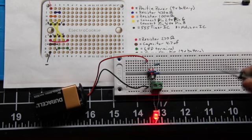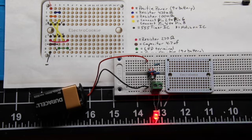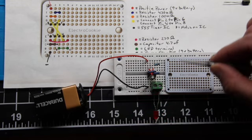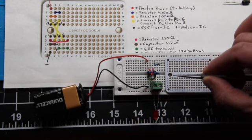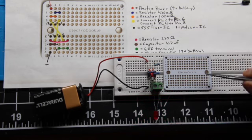So we've mocked this up on the board, and I would tell you I'm very bad at spatial relations. So what I did is I just got a pack off of Amazon of PCB boards that basically mimic the breadboard, so that I can just take what I've done here and knock it right off verbatim, or exactly, onto the actual PCB board. As you can see on the back side of this, actually that's a good view of what the inside of the breadboard looks like. You can see we just got rows of copper, so that anything on that row is connected to something else on that row. So that's the logic, as it were, in my choosing this particular breadboard, which I got a pack of these off of Amazon.